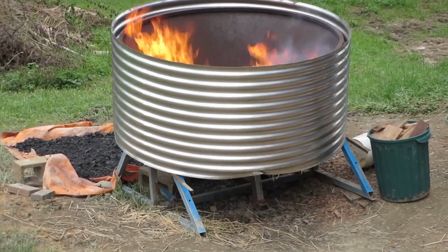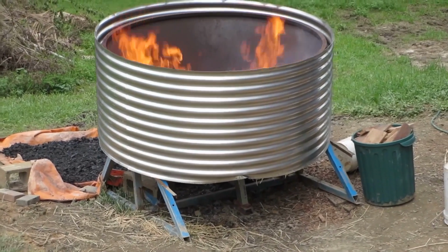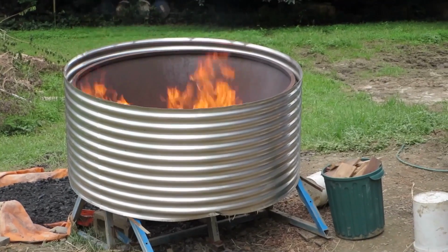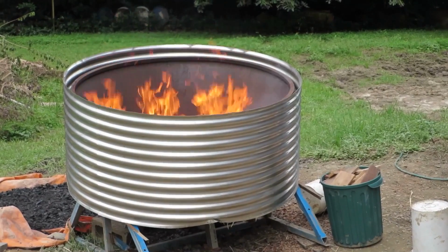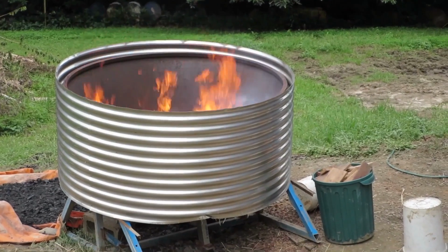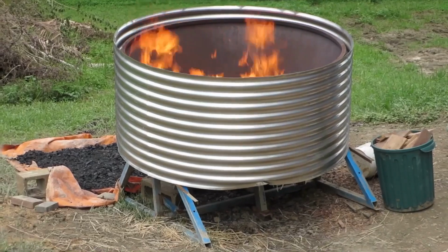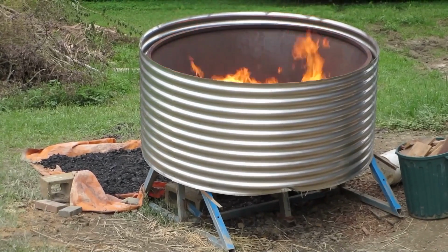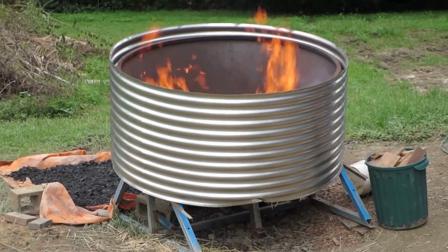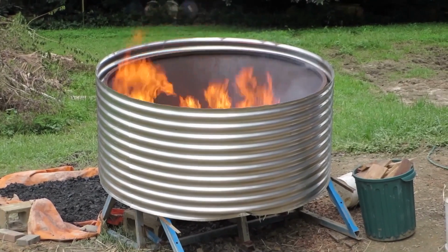We've got thermocouples 15 centimeters from the bottom and about 41 centimeters from the top of the cone, measuring temperature. The bottom thermocouple right now reads about 542 degrees. You can see some char laid out that came from the previous batch. That was actually a biochar mineral complex where we used wood chips and wood blocks and also gypsum. So we made a gypsum biochar complex.